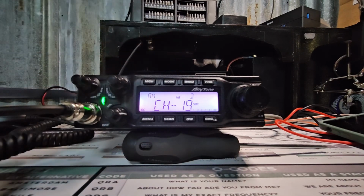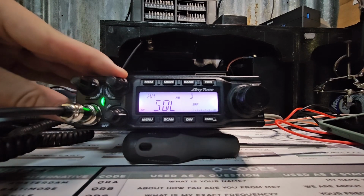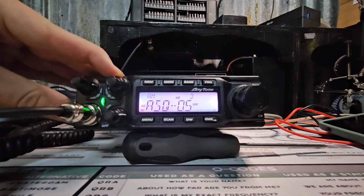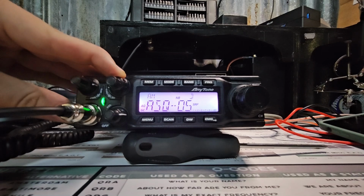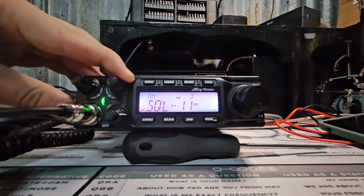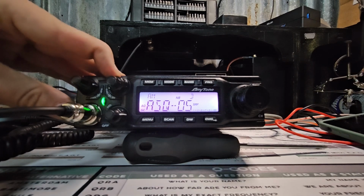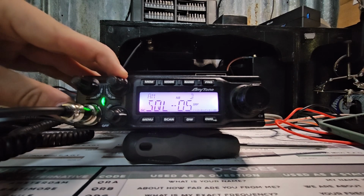There's your typical noise balancer, ALC and stuff like that. But one thing that I do like is the auto squelch feature, where you can set that squelch and anything above that will come through. It's kind of like just setting your squelch adjustable, but it's an auto squelch. Personally, I like to set mine, but a modern radio, in my opinion, should have that auto squelch.